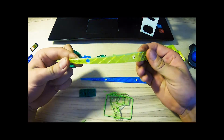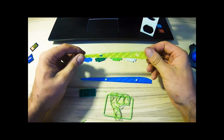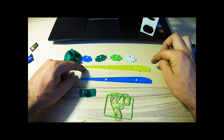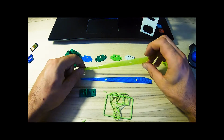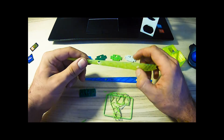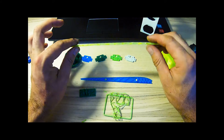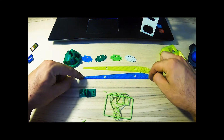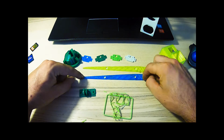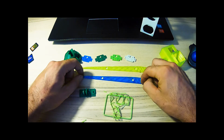But yeah, and also just because you print your parts flat, and this is PLA, I peeled it off hot, and so now it's just a little bit warped. But if I lay it back on the bed, which I'm getting ready to do, and clean up the glue, lay it on the bed, the bed will heat it up, and it'll lay flat again. So you can see this one's real bad too. But PETG is much more temperature tolerant, so it's harder to do.